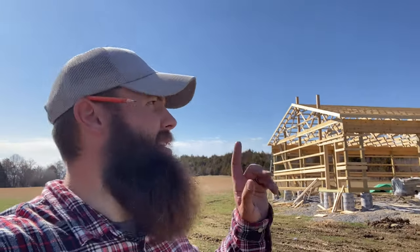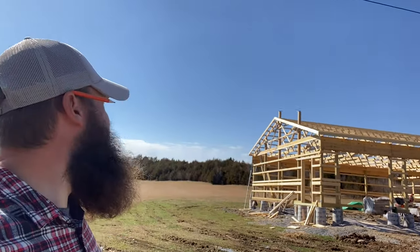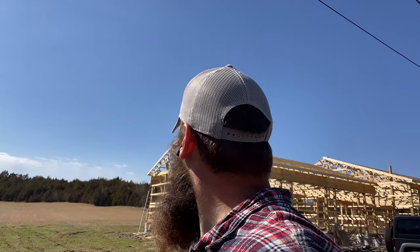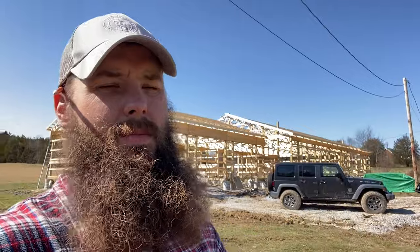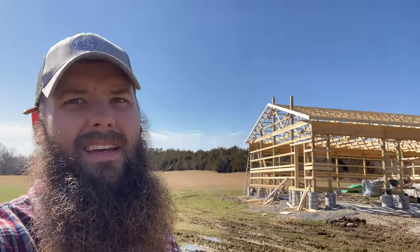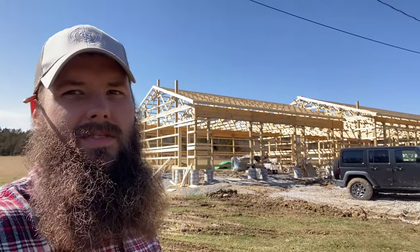That's probably where we'll leave this video. I'm probably not going to film the soffit onto the side — we'll just jam that out real quick in the process of doing some sheathing. That's how I do soffits and fascia. It came out pretty good. Looking at it now, maybe I would have done 18-inch or two-foot overhangs just because of the size of our buildings. A couple of people have been asking — the garage is 40 feet across the front and 32 deep, and the house is 64 across the front and 40 deep, so the house is about 2,560 square feet and the garage is 1,280. Thanks for watching, thanks for subscribing, and we'll see you on the next video.